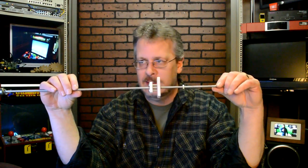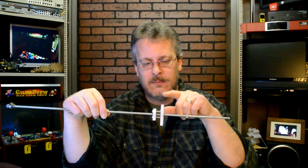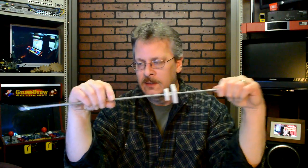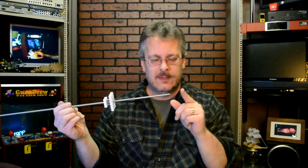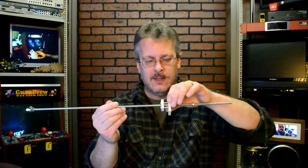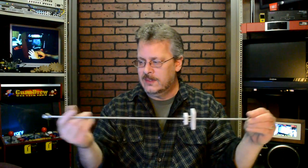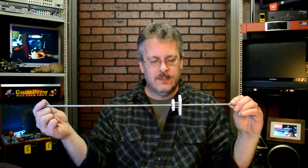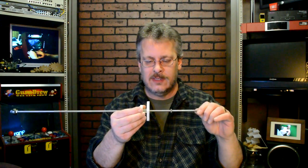This is actually the shaft out of my homemade CNC machine, and these are my homemade backlash nuts. Let me explain what backlash is first of all. Imagine that this steel rod is in the machine — it's secured at one end and at the other end with my stepper motor. This part is hooked to my axis; in this case, this is my Y axis. These two ends are secured and this is allowed to move, so when this rod turns, this thing can go back and forth. That's how the CNC machine works.